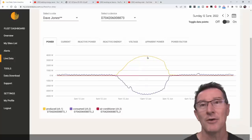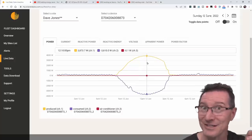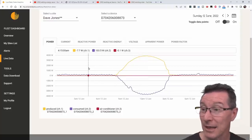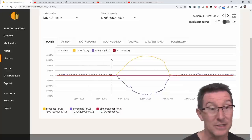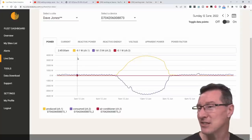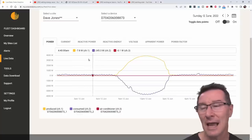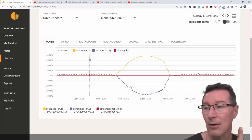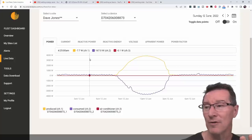During the day, we don't know how much power these things take — but it doesn't matter. I'll show you the architecture: it's actually powered from the DC side, not from the AC side. But at night time, the yellow curve disappears — you can see the answer at the top. It shows negative 7.6 to 9.1 — let's say 8 watts. So that's 8 watts real power, not apparent power — real standby power for the 14 micro-inverters.